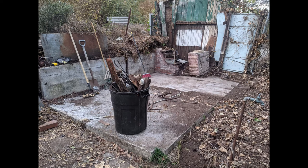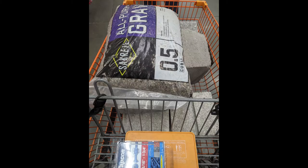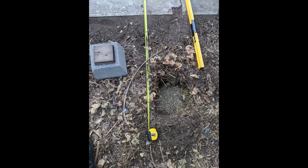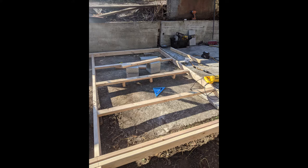I want to utilize the slab at the top of the hill — it's about 8 by 10 feet, but it steps down and is a bit crooked and busted up. I still want to use it to build the platform off of so I have one area with a solid floor for heavy gym equipment. After cleaning up the space I ran to Home Depot and picked up pea gravel, concrete anchor screws, different sizes of cinder blocks, 2x4s, and OSB. I dug out holes for concrete pier blocks to start leveling where I'm extending the platform. There are actually three different slabs at different heights — some are uneven, some are busted up — so I needed to decide which ones to build off of and which to level up.